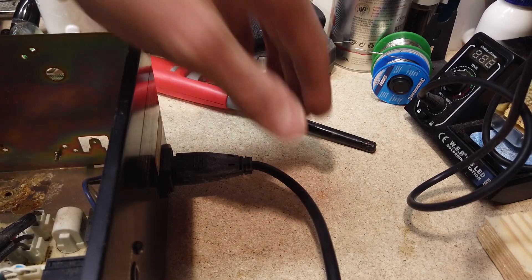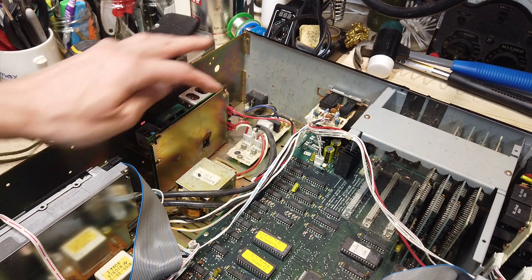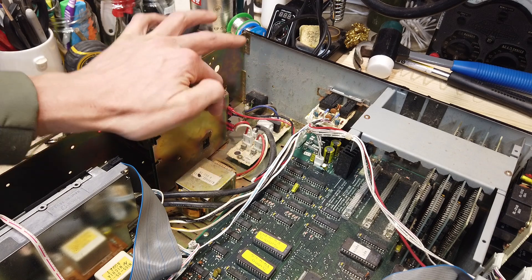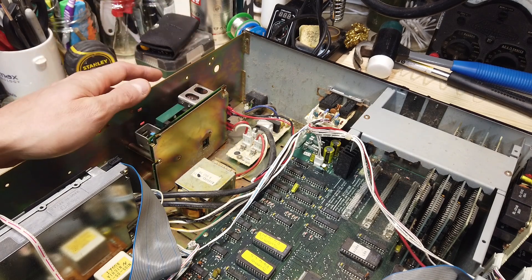Let's turn it on and see what happens. It's tripped all the electricity — which isn't necessarily a bad thing, at least it gives me somewhere to start. Main suspect right now is this 5-volt power supply. The fuse in the mains distribution block is intact, and it feeds out to the 5-volt and 12-volt supplies. There's not much to go wrong with a transformer, so this power supply is the main suspect and I'm going to remove it.